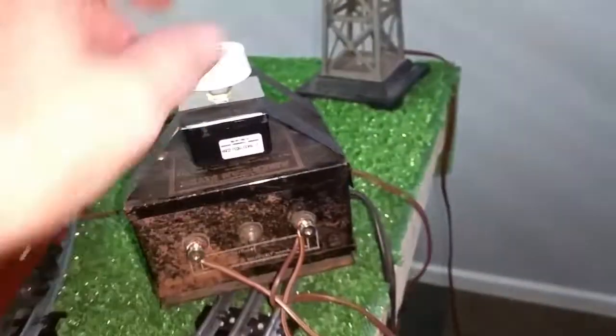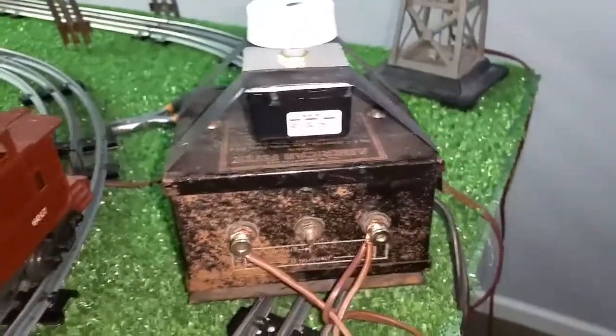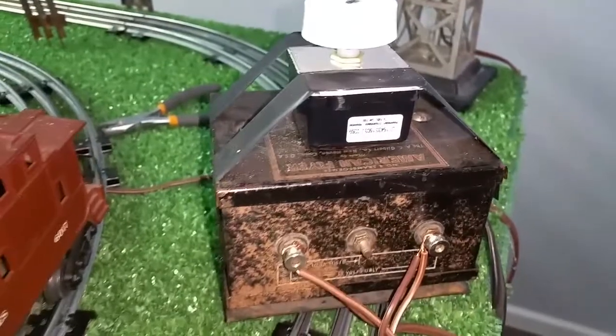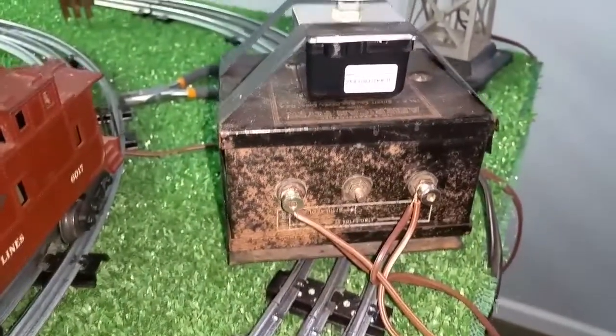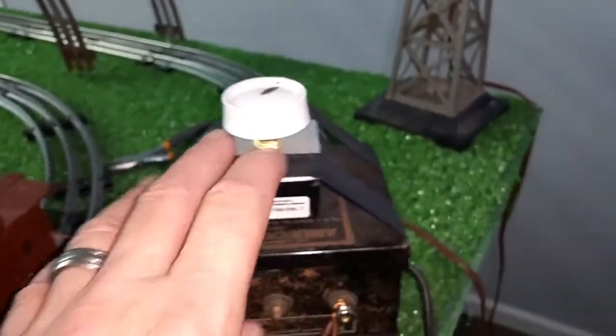This works, it's really cheap. This dimmer is rated at 1600 watts — incandescent or halogen — so it won't even get warm running the 75 watt transformer. And this is not just a rheostat; it's actually an electronic circuit in there.